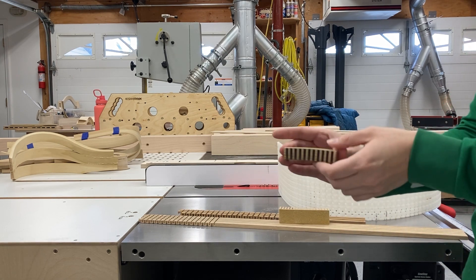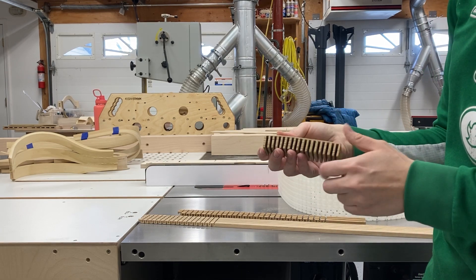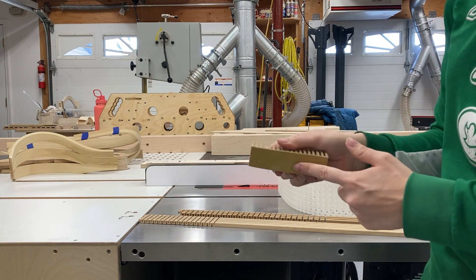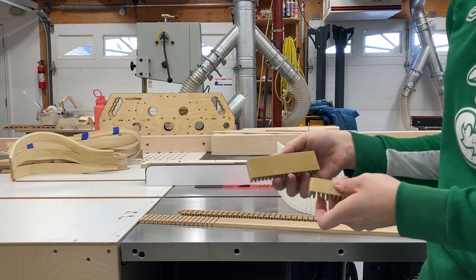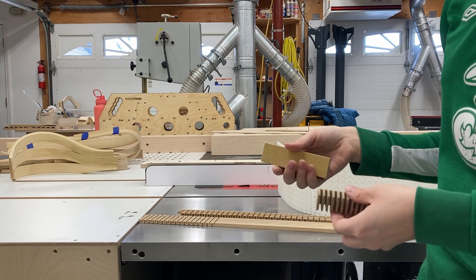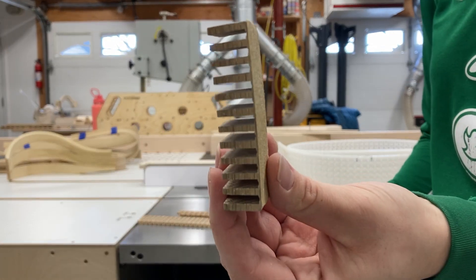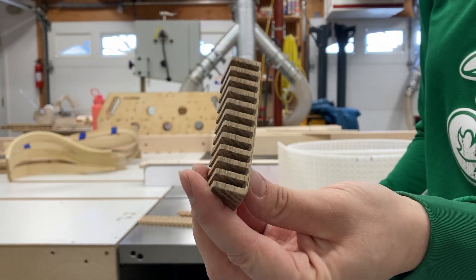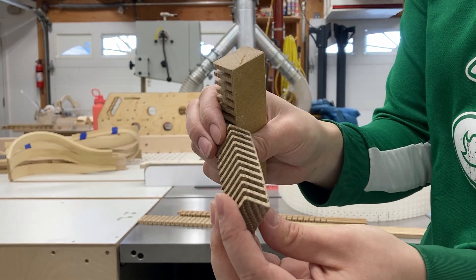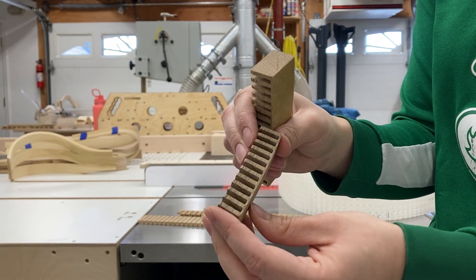You may have seen these already. I use these as little sanding blocks and they work great because since I've only curved them in one direction, they only want to bend in one direction. They're really great for smoothing out two-dimensional curves without worrying about rounding over the surface or creating little bumps, low points, or inconsistencies on my curve. You'll notice that especially on this kerf block there's almost no material left — out of the long grain material there's probably a 32nd at most — and the rest is short grain, but that short grain still adds a lot of rigidity and structure to my curved blocks.